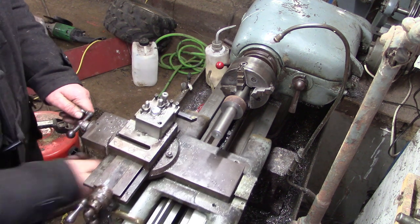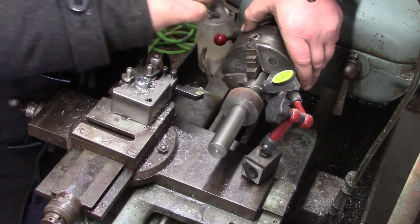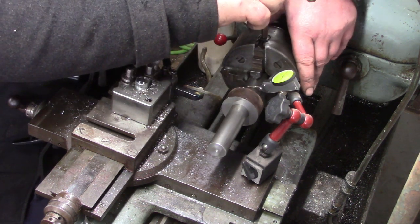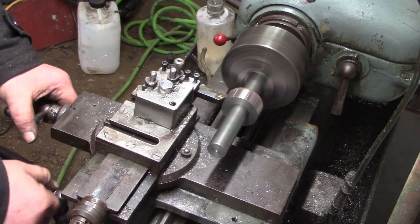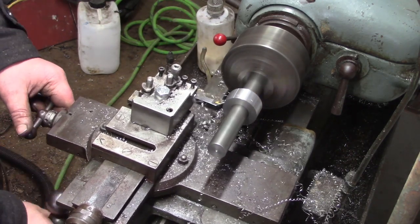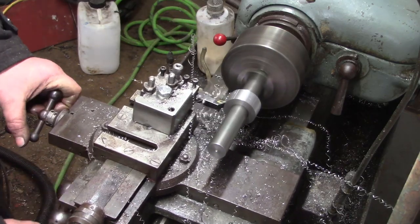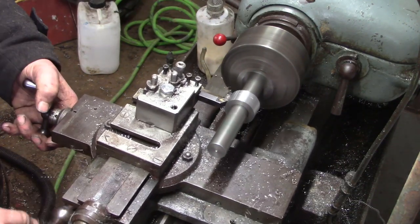You can see that I've welded a lump of something on the end of this drive shaft - this is the outer end of the drive shaft. We're going to put the features in so it can sit in a bearing, take the hub, and also take a nut to hold the whole lot together. This is a lump of steel that's going to come on the other side of the bearing, and the hub's going to pinch the outer edge of the bearing.